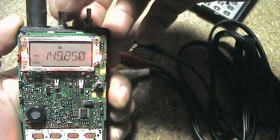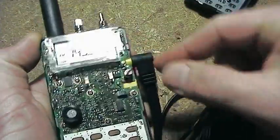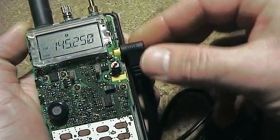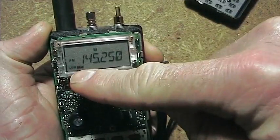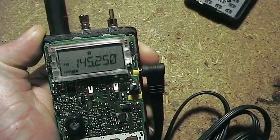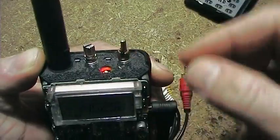It's easy to demonstrate — I've just got the antenna on there, and if I plug that in all the way, you can see it actually goes all the way flush with the socket that's soldered onto the PCB. But if you pull it out a little bit — there it goes — that's the low power TX and you can just hear my other radio receiving it. That's pulled out about a millimetre or so; you can see the TX light up.